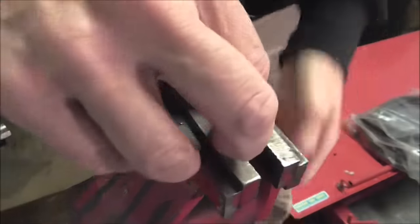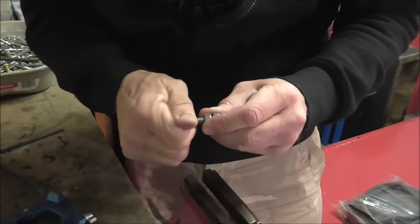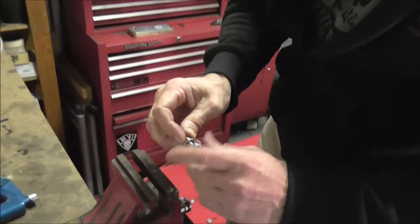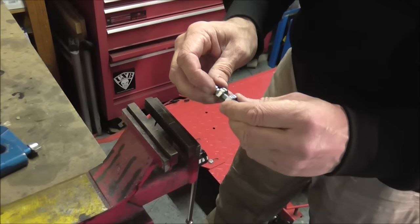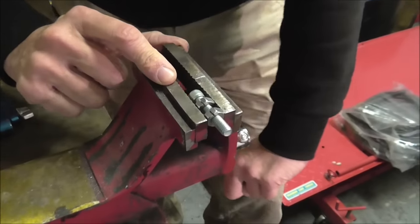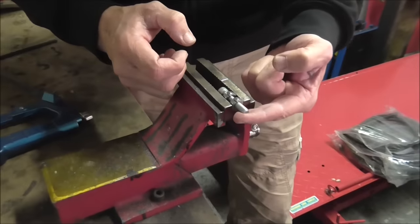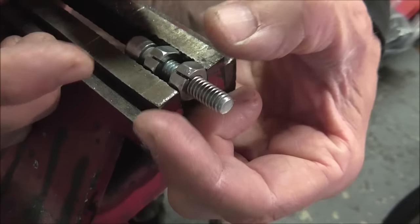Once you're through, take them off and wind the bolt into them. Once they're both on, the idea of putting these splits in them is that they're squashable — you can space them apart. Take one in as far as it will go. This is on an Allen bolt; if you've got a regular bolt head instead of an Allen bolt head, you can just use one nut. Put those in the vice. When you squash them in the vice, they'll close together around the thread. But because they are nuts, they are the same as the thread — they won't damage the bolt itself. They'll keep it nice and safe, and the bolt is very securely fitted in there.